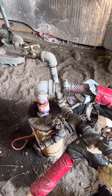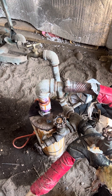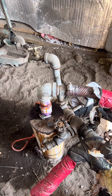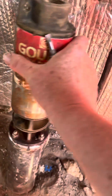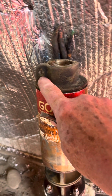A good well man should always rope his pump. I don't care if they've been in business 100 years or 50 years — a good well guy will rope that pump. There's a little hole in these that you can feed a rope through. See that hole right there? It's meant for a rope.